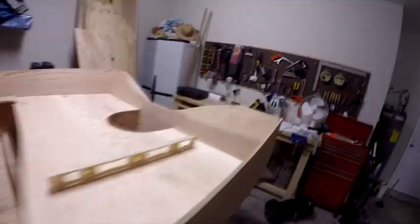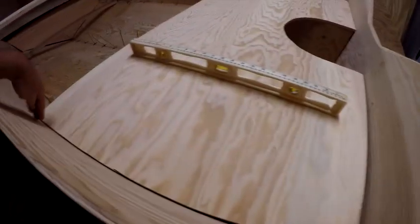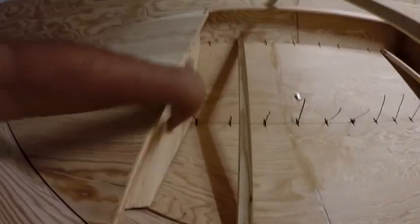It's cold and rainy out so today I'm just doing some sanding and cleaning things up. I'm still stuck with this predicament: I can't get the seat bulkhead flush with the transom because it's too wide. The supports are about two inches too long, as is the floorboard — which I took out — also about two inches too long. Nothing's fitting properly here, and on top of that the forward bulkhead doesn't fit straight because it's too tight, which leaves a gap in the bow.